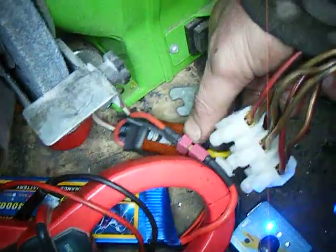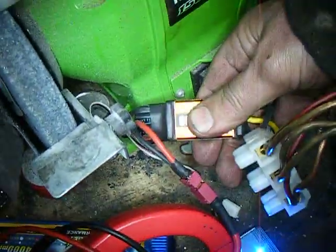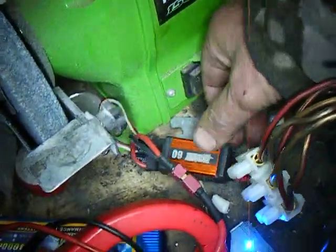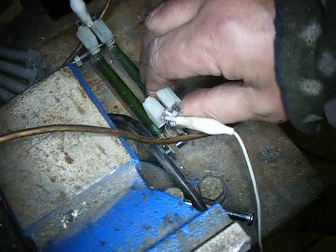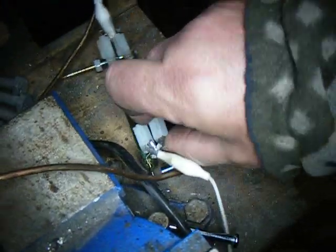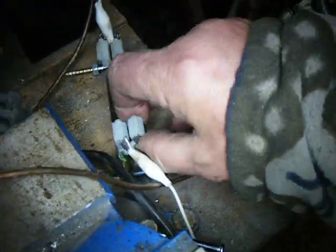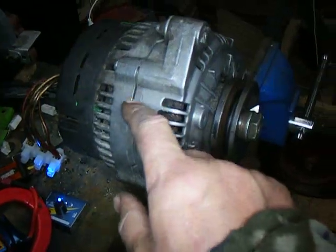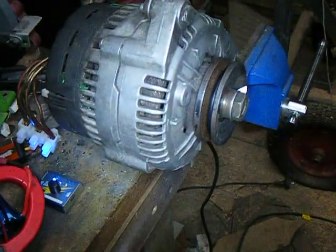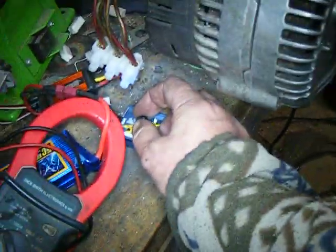I do have to watch out though, as this little golden brick will get hot if I'm not careful. I figured I'll put a fan on it so it doesn't smoke. Now if I select a higher gear, I'm putting another resistor in, and that's reducing the current on the armature windings to a lower figure than before, which makes it go faster but you lose torque.